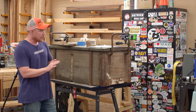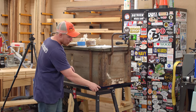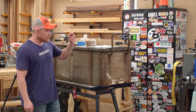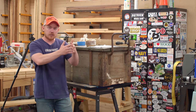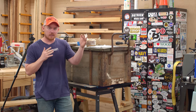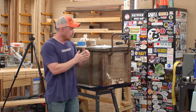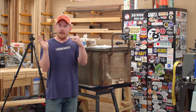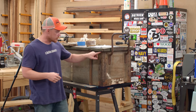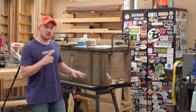1850s, granted. It's a full dovetail joint all the way down. The top and bottom are mitered, right? And then a dovetail joint has a physical connection in one direction. That's the whole point of a dovetail joint. It's really strong in one direction and it can't physically pull out. It's a mechanical joint. Well, the other direction, it can. You have to rely on glue or pin it in some other way. Well, this is glued and it's also pinned.